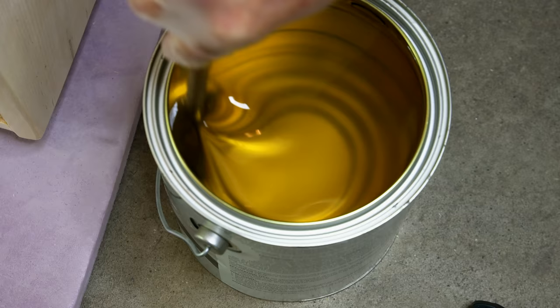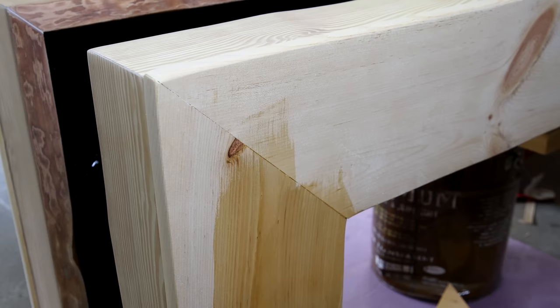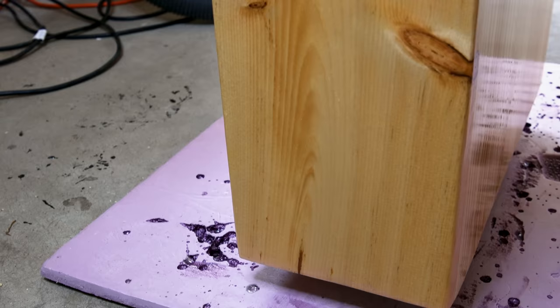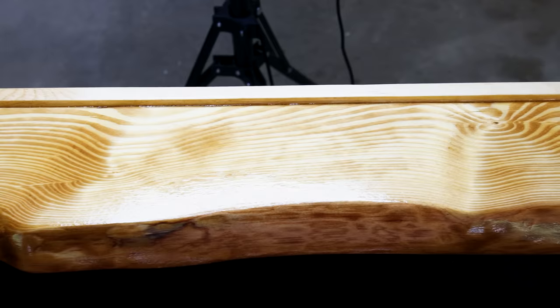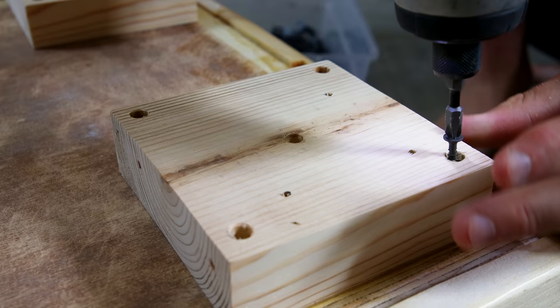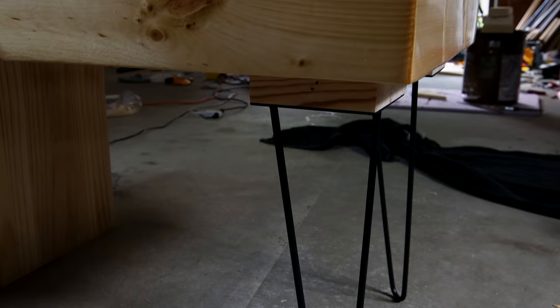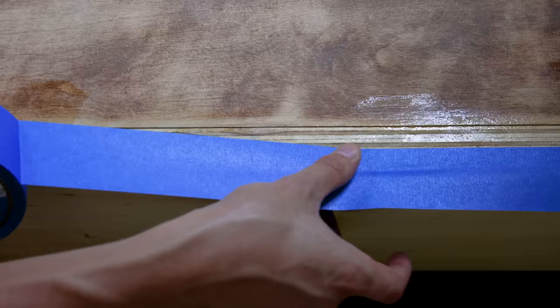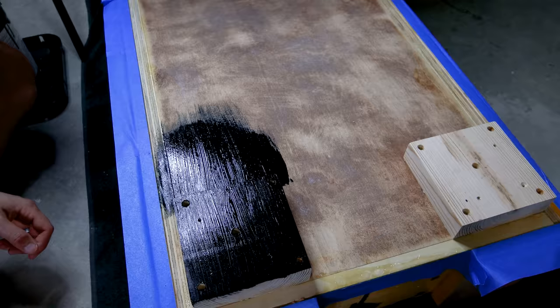This time I decided to use lacquer on the exterior. It dries much faster than epoxy, is waterproof, and will provide a comparable finish. Now I know for next time — only use epoxy on the inside. I applied seven coats of lacquer. Sure, I was annoyed doing this, but I actually prefer it over the epoxy. It's not quite as glossy, and the natural color of the wood shines through. I drilled holes in the spacer blocks to fasten them to the underside, secured the legs, and once everything looked good, I disassembled and glued the blocks in place. I also taped off the entire underside to paint it black. Once that dried, I reattached the legs to complete the main structure of the table.